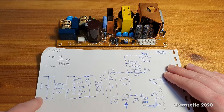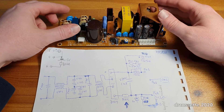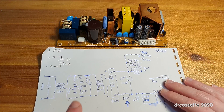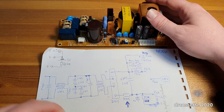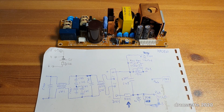The mains comes in over here and goes through quite a lot of mains filtering, which on this board is in this area. Interestingly, part of this circuit is repeated outside in the VCR. So not even the Sony engineers knew exactly what kind of power supply they were going to get. We then continue into the rectifier bridge, which is right here.